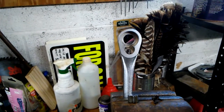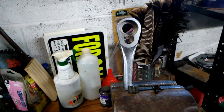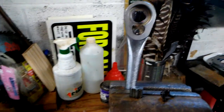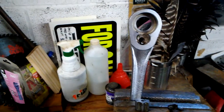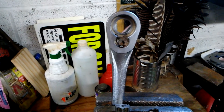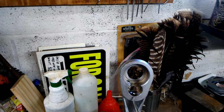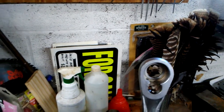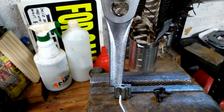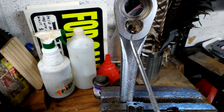After 30 years of service, my Craftsman half-inch ratchet needs maintenance. We took it apart, sprayed it out with brake parts cleaner, and are reassembling. Craftsman's instructions with the rebuild kit show a tool — probably a home-built tool — to depress the little ball bearing. There's a spring under that and a ball bearing sitting on top of it. This piece has to go in the back first, fitting inside the other piece, and we're going to compress that ball with a jigsaw blade.